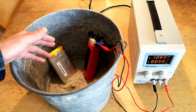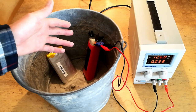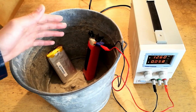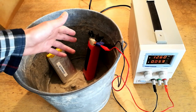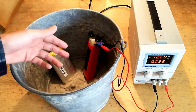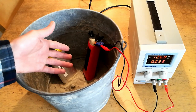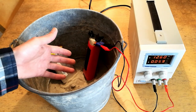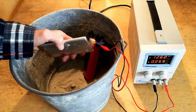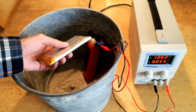If you don't have access to a recycling facility for lithium batteries, then you may have to dispose of these batteries in the landfill waste stream. If you have to do this, then it's extremely important that you discharge these cells and these batteries all the way down to zero volts and maintain that zero voltage level for a very long time before disposing of them.